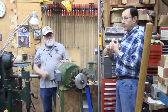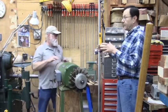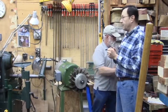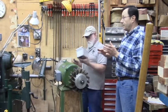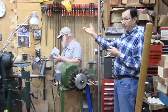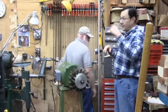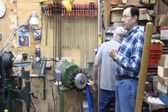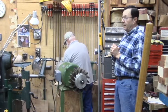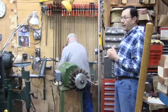The same thing is true with a bandsaw. You go variable speed in the bandsaw if you're into metalworking. And for sanding, feet per minute is important too. You'd have to get into a little bit of the literature that the abrasive companies send out, but lots of them will recommend a specific speed, like 1,200 feet per minute for their particular belts. So if you're running a 3450 RPM motor with a straight belt right off of it, you might be getting somewhere in that 6,000 feet per minute belt range. And at that point, you're burning wood very quickly. So if you've ever burned wood on a belt sander or turned a bit blue on your drill press, that might be because you're running too fast.